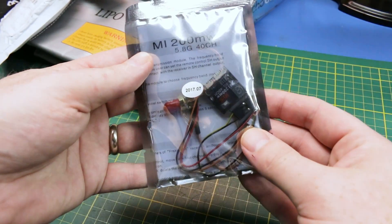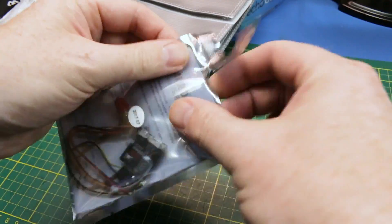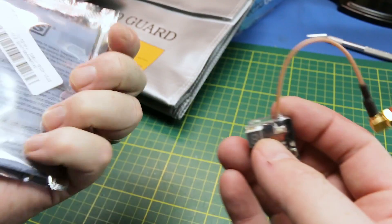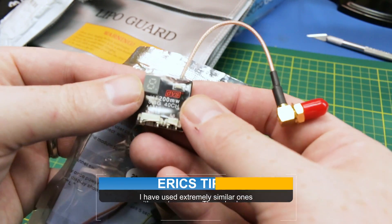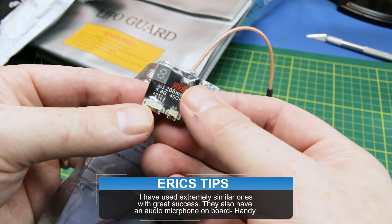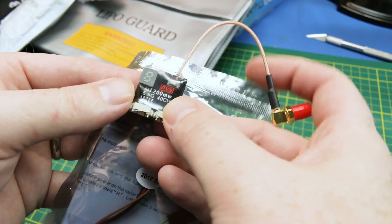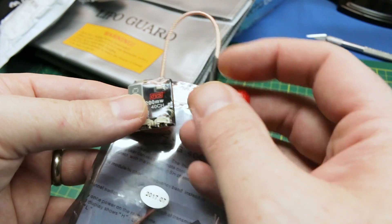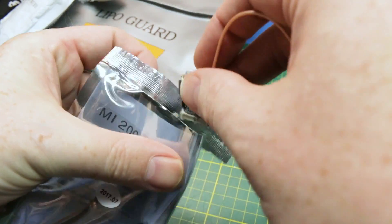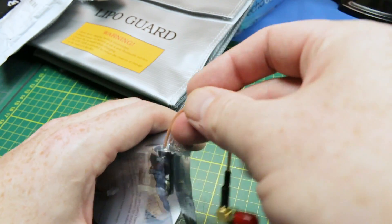Next up, I got myself a 200-milliwatt video transmitter for my FPV stuff. This is a model I have never used before — this is a DYS — and I'm not familiar with it. This does not appear to be switchable in any way, so this is static 200 milliwatt. I like the ones I can switch between 25, 200, and 600 milliwatts, but I really needed one with this remote SMA connector in a bit of a time crunch for a project. So I took a flyer on it. The price was exceedingly reasonable.